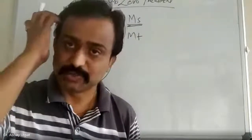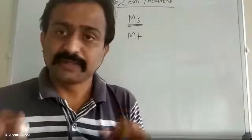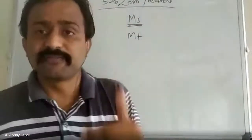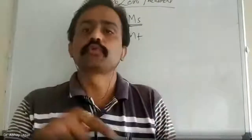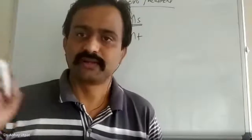In measuring instruments, gauges or bearing components, we require 100% martensite. 100% martensite depends upon the MF temperature. In a few of the alloy steels, or in many cases, the MF temperature is below 0. Hence, we need to cool below 0. Now why? Next paragraph. If retained austenite is there in the components and during working condition this retained austenite converts to another phase, there will be a slight change in dimensions, which will cause misalignment in the bearing part and leads to accidents. Hence, bearings, measuring instruments, gauges are sub-zero treated.